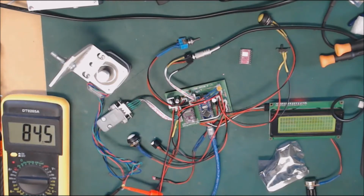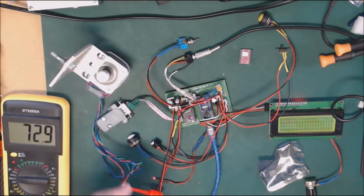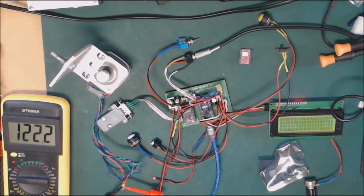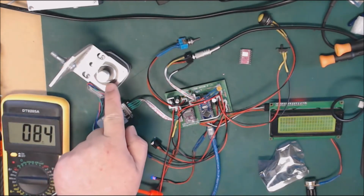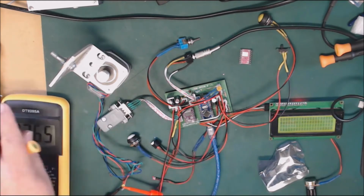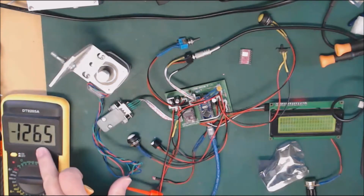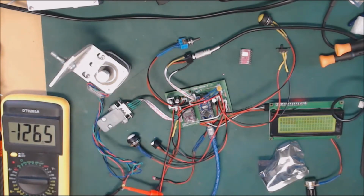So now let's try quarter steps. Set mode. And I'll tell it to go about another 2,500 steps from where it is. And you notice that it's stepping fine at quarter steps. So I started off with full, and then I went to half, and then I went to quarter, and just kept adjusting it a wee bit. I'm not worrying about what current's being shown on the meter. Currently it's showing 126-odd milliamps flowing through.